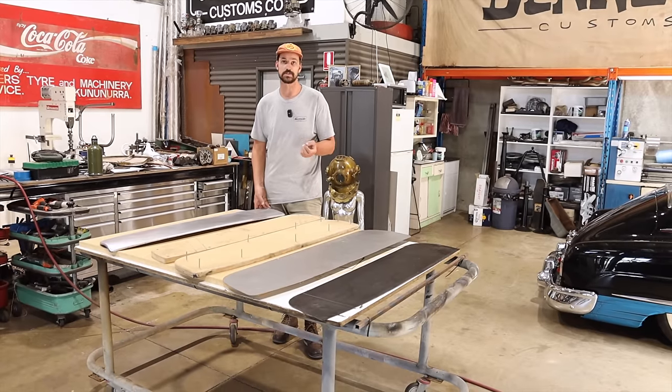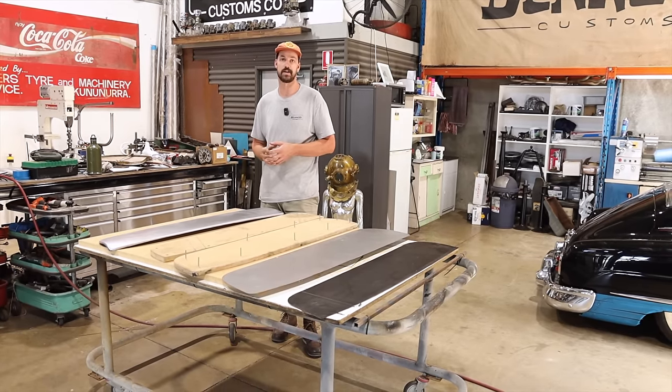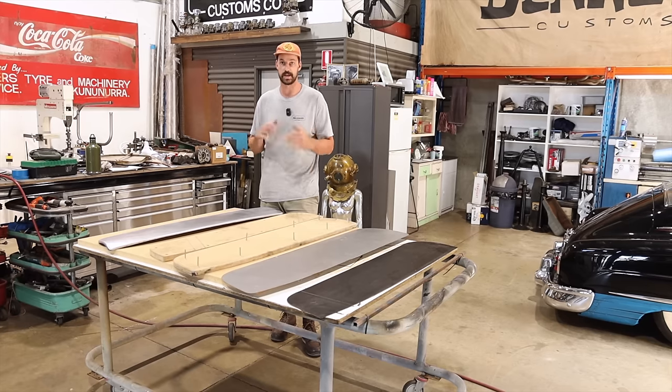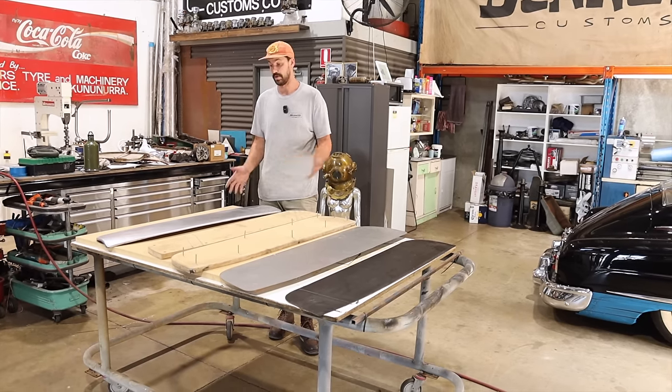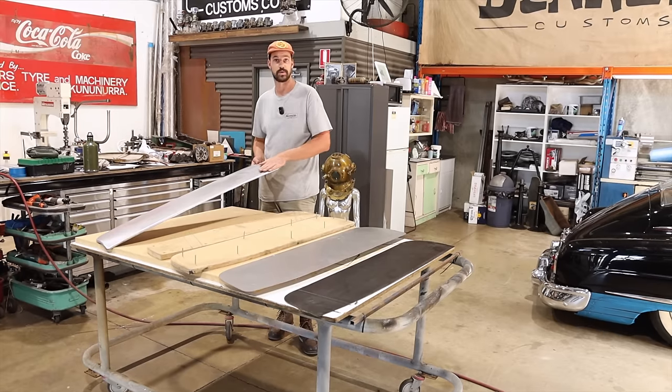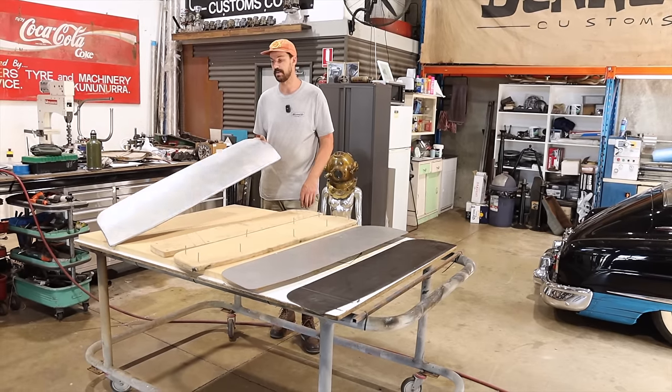Another bit that you could use in those is a bit of silicon bronze, purely because of the melting temperature of it, so you're not putting any distortion in there. But luckily, having that copper backing plate really gave me no distortion whatsoever. Obviously it just sucked the heat right out of the sheet metal, which was awesome.